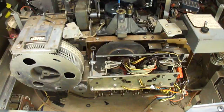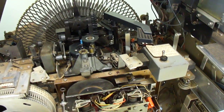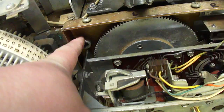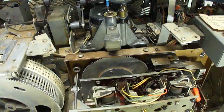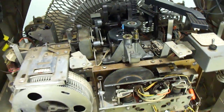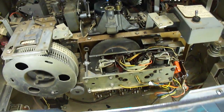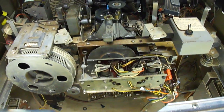So this concludes the introduction to the pulse converter system. I'm going to take the pulse unit off the jukebox and talk more in detail about the different components of it. Luckily, it's very easily detached — there are two Allen screws here, and this hangs on a little hook. You remove the Allen screws, take it off, and there's just a coupling that couples mechanical energy from this wheel back to there — it's just a little crank that fits into a crank arm. So in the next video about the pulse converter, we'll talk more in detail about its operation and some of the contact repairs I had to do to it.